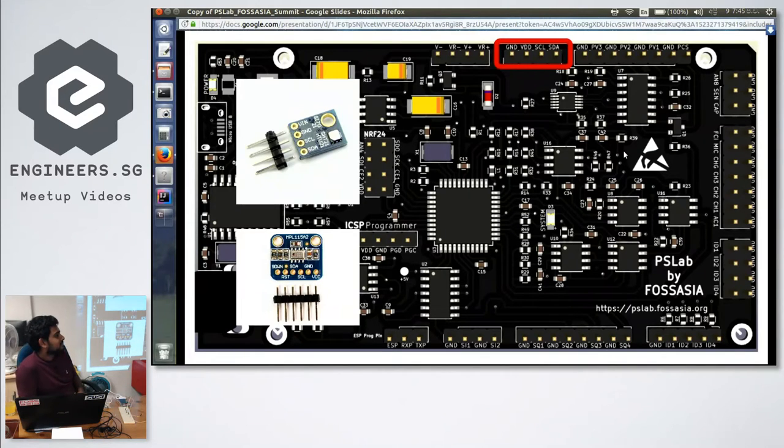Okay. What kind of power does it require? Can I make it stand alone and leave it in the garden? Yes. And how would I keep the data and then collect it at a later time? For that, you will have to use an ESP. Connect it to a laptop all the time? Yes, without an ESP, you will need a wired connection. With ESP, you can have it as an access point. Connect some mobile phone or laptop to that, and have the application fetch the data at some interval, and you can get the data.